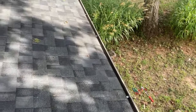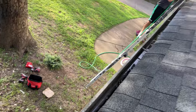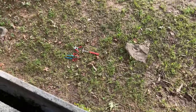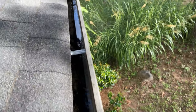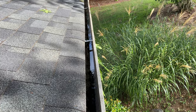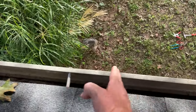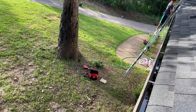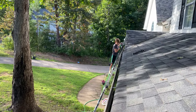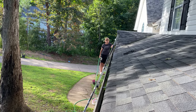What I'm trying to accomplish here is mimic rain — I'm having Kessler load this gutter up with water so I can see how it drains. Obviously a couple of hours later there probably will be a little bit of water in here, but I shouldn't come back tomorrow and still find water in the gutter. We want to avoid that. It's definitely working — alright, stop Kessler! I just wanted to fill the gutter, not pressure-wash it. Somebody's having too much fun.